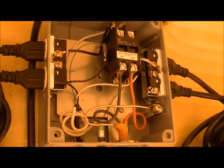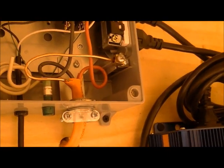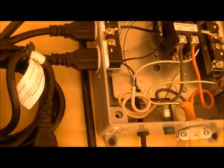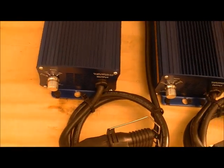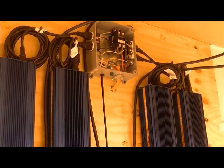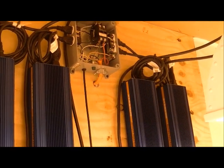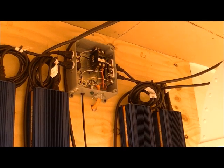It works, but I want to get a digital timer. Anyway, you can see how this is wired: you bring your power wire in, two hots and your ground, and then this box itself should already be pre-wired. As long as the ballasts are dual-rated, they will be fine — you won't have to worry about it. Kentucky Stoner, I hope that helps. Any other DEN members with electrical questions, feel free to ask and I'll do my best to respond in the comments, reply to the email, or make a video if that's easier. If you have any more questions, hit me up, brother. Peace.